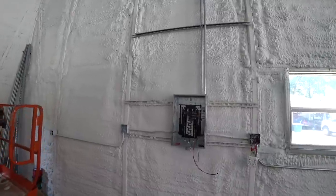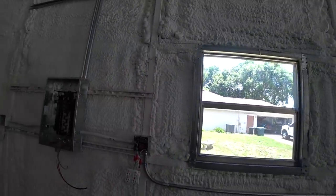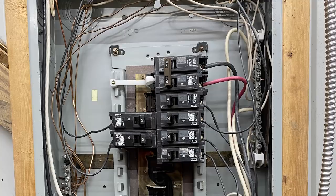They're getting most of the way through this. The panel's in, they still got to run the power wire from the house. We are doing a 100-amp service off the house since service was already run out here for the building before. It would have been nice to go with a dedicated service from the power line and run a meter on this and a meter on the house, but that was going to take a lot longer and be more complicated. I just wanted to get it done. I think the 100-amp service should be plenty since it's just me working in here - me and Josue. We're only going to be running one high-current thing at a time. It had 40 amps before and we got by just fine.